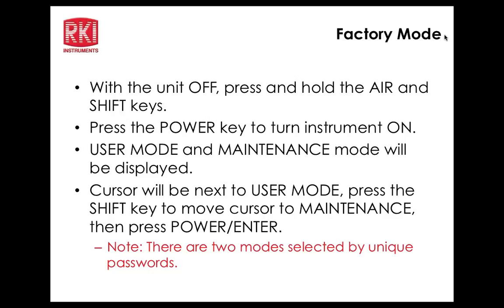I still am not able to access my bar hole mode. I turned them both on, but right. Yeah, you can't, Don, because the bar hole mode can only be accessed if you have a volume sensor in there. Since that sensor is not even available now, you can turn on the mode, but it'll only show you leak check because you don't have the right sensor. Right. Good. So in that sense, yeah, the unit's smarter now than the other ones used to be.